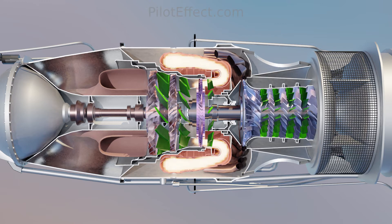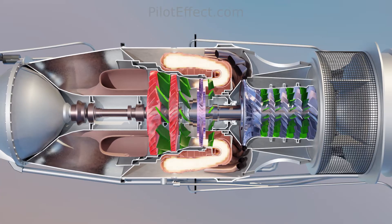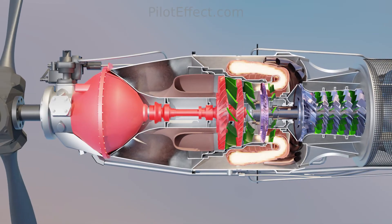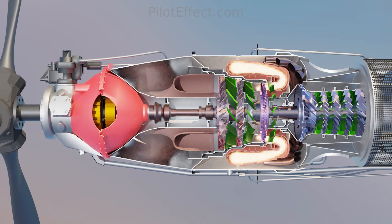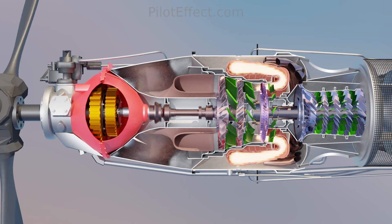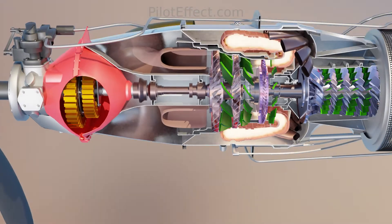At this point the heated air is exiting the gas generator and entering the power turbine. The power turbine has one or two axial stages depending on the engine model. Like the compressor turbine, the power turbine extracts energy from the airstream, and this energy is output by the power shaft to the reduction gearbox. The power is transferred from the power turbine to the propeller by a two-stage planetary gearbox. The reduction gearbox receives power at a high rotation rate and low torque, then outputs the power to the propeller at a lower rotation rate but higher torque.